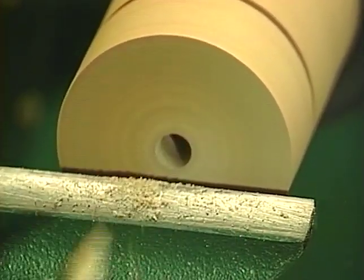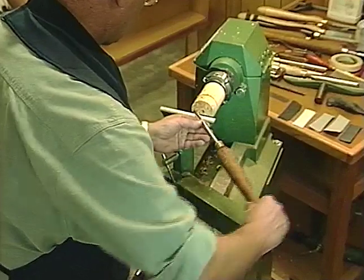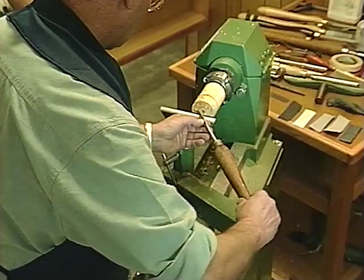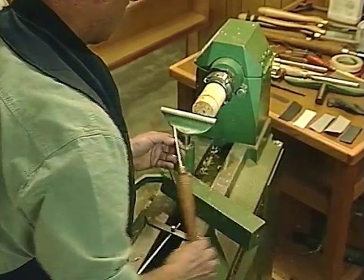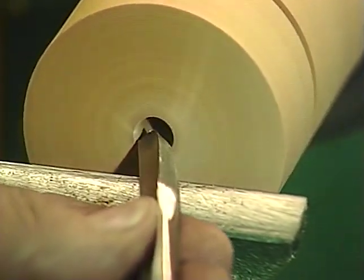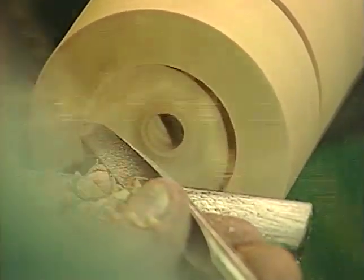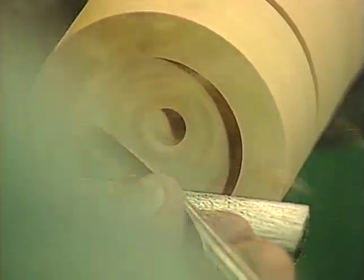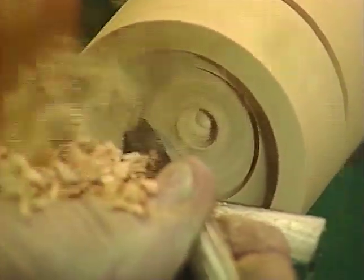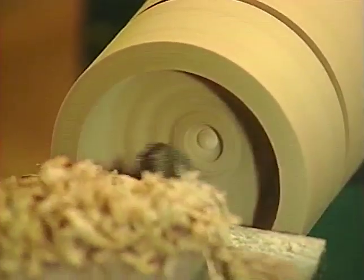What we're going to do now is to just show you the movement that you need to make with this gouge with the lathe switched off. You can see there's a lot of pivoting movement there. The flute of the gouge is positioned so it's about 45 degrees out of the vertical. And you can see that it's a pivoting movement. The tool is held very lightly on the front end with your index finger and thumb. All the movement comes from the right hand as you pivot that round. That short bevel allows us to get support as we manipulate that tool. Continuous, repetitive cuts with a pivoting, almost like on a fulcrum.